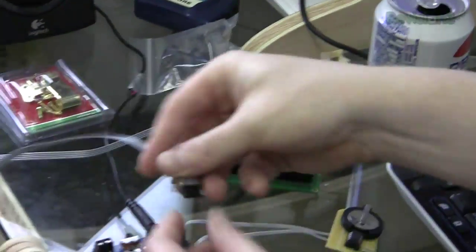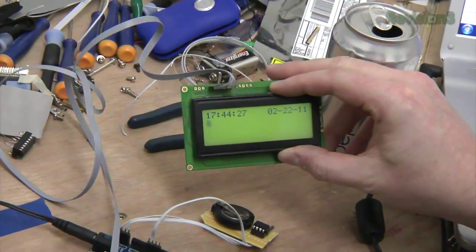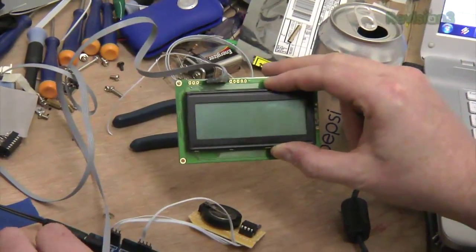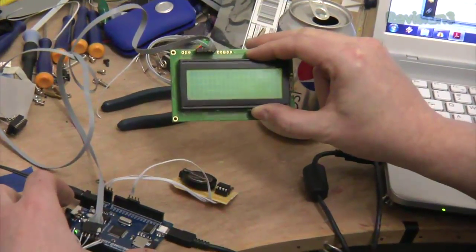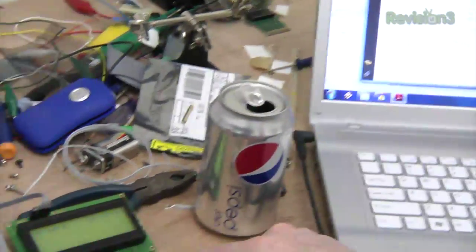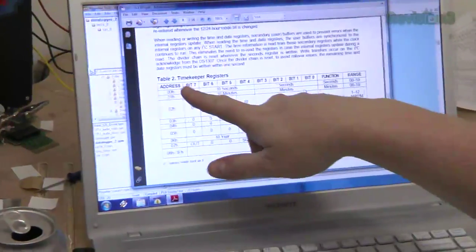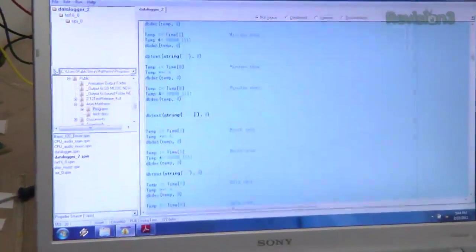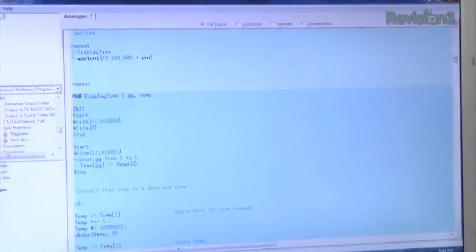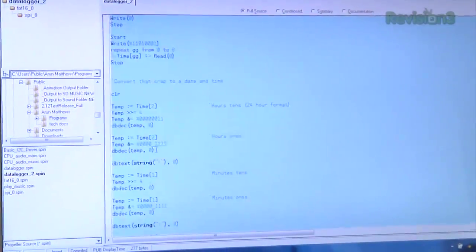So that's what we're going to do. There's also a serial debugger so we can see what the machine is doing for debugging. We've got the output in military time — it's 5:44, the seconds are counting, and there's the date. Even after a simulated power failure, the battery keeps the time going. The data is organized by accessing the integrated circuit using the I2C bus — there are seven addresses you can read, starting at address zero. We read them into the computer and put the first six locations into our time array, then slice it apart.